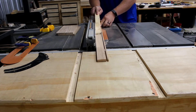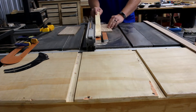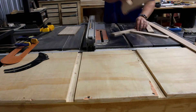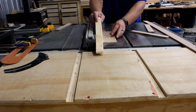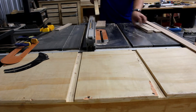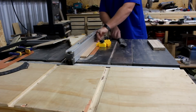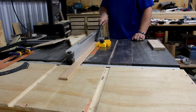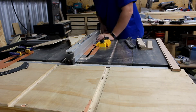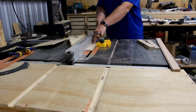This is another piece of oak from my scrap bin and I'm going to cut these down — I actually get two boxes out of all these boards. While still at the table saw I'm going to cut a groove in the bottom of these. This will be for the bottom to slide into. I'll move the table saw fence over and repeat until I have the right width.